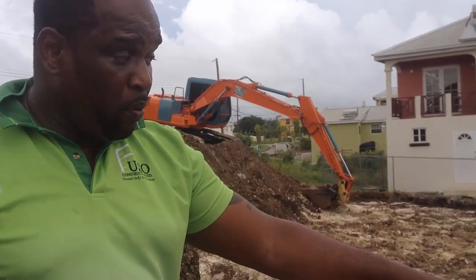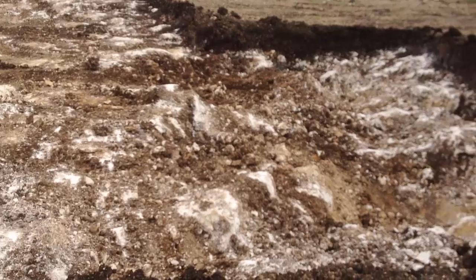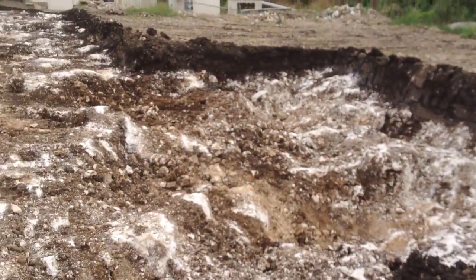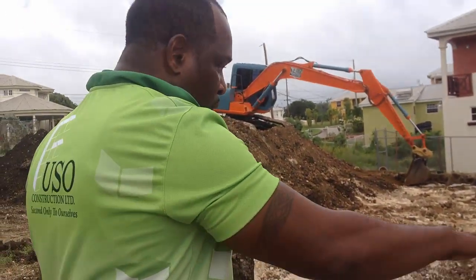In areas where there are deep holes, the roller I normally use cannot get on the wall, so we fill the hole right there by hand and let it set, so the compacted material is solid enough that the roller will just roll right through and compact it.